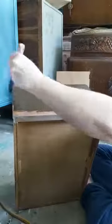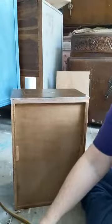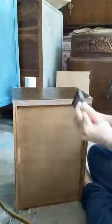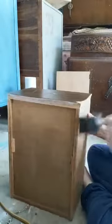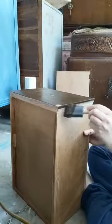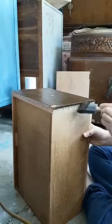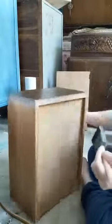So when I use the gel stain, the General Finishes gel stain, I always seal with the gel top coat. It's called gel top coat, and it's urethane. It's oil based, right? So it's nice and strong. I never ever put a water top coat on an oil stain because I don't know what the point of that is. You're putting a weak product on top of an oil stain. Why not use an oil sealer? An oil sealer is way stronger than their top coats.